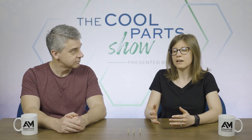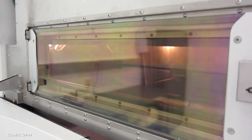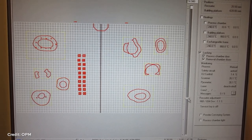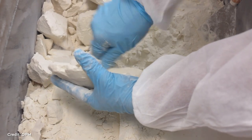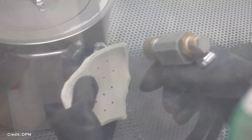And I want to introduce Scott DeFelice. He is the founder and CEO of OPM. He can talk more about how they use this technology. The printing is done in-house. We use EOS machines that we've subsequently modified for the purpose of our high-temperature process. A powder bed melting process is really a pretty advantageous process, and that allows you to get fully consolidated, fully dense parts with highly repeatable mechanical performance.